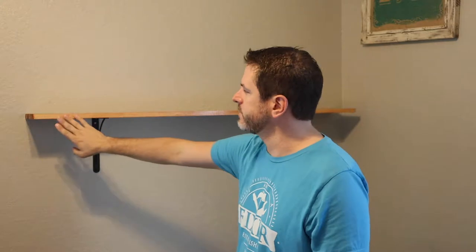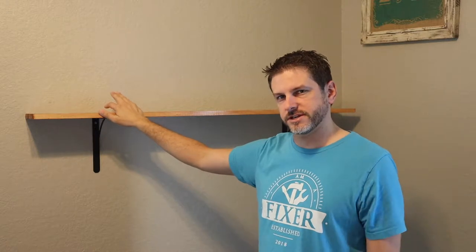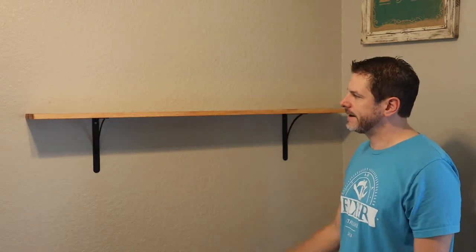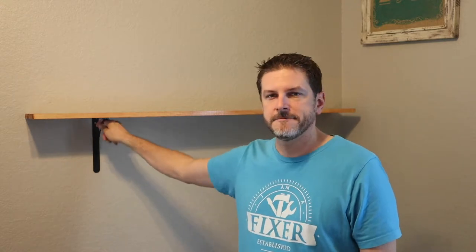I'm just finishing putting up this shelf. It came out fairly well — I'm not extremely happy with it. There's a couple spots where I had just a little bit of excess stain. I don't know if I like the stain and gloss all in one; I'd probably stain it separate and then gloss it separate next time. I'm going to try to sand down one little high spot. All in all, it's a pretty straightforward process. Make sure you have screws that aren't going to poke through — some people just grab whatever screws come with the bracket and they're too long. That's it, fellow fixers! I'm Jeremy Schick and I'm a fixer. Thanks so much for watching. Like, share, and subscribe — I'd love to see you on the next one.